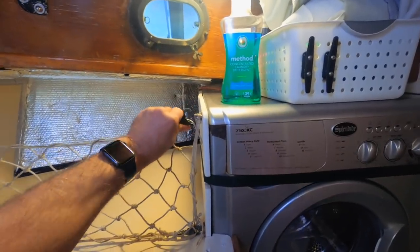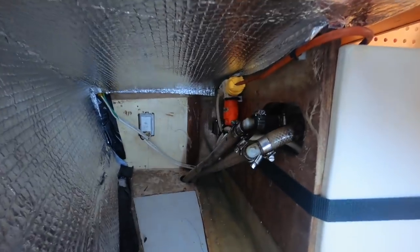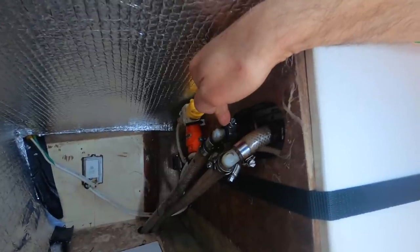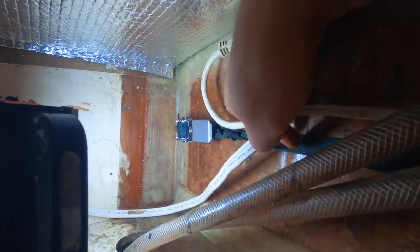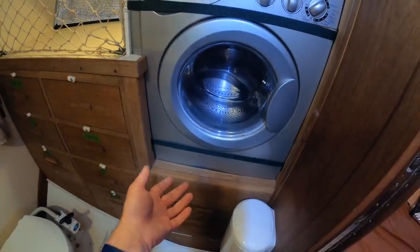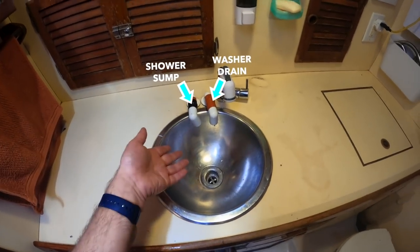On the back of the washing machine there are three hose connections: two freshwater inputs and one dirty water output. One connection is for cold fresh water coming from our tanks. The other is for hot water going through our hydronic boiler so we can wash with hot water. You can also see the stainless steel ratchet securing the upper webbing strap. The third connection on the bottom is for dirty water output — I connected it to a hose routed behind these drawers, behind the sail locker bulkhead, and over to a port where it drains out into the sink and goes overboard.